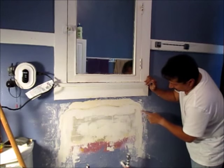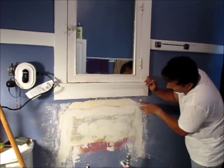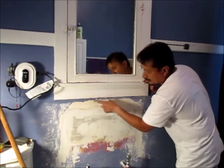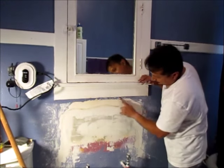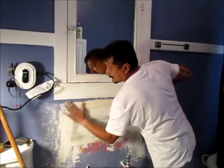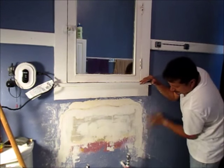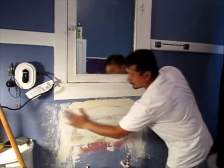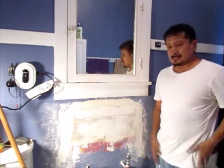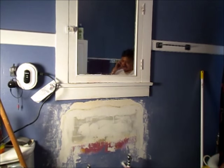I need some more right in this area, just a little nick here. I need to bring the compound up to here because this right here isn't feathered just yet — you can feel the difference. Today I'm going to bring the compound up here and fill it in right there. Looking at this I could probably get away with just two coats of compound on this, but I'm probably going to do three. This paddle is bigger than the one I had yesterday, and I'm going to try to bring the compound up to the top today.